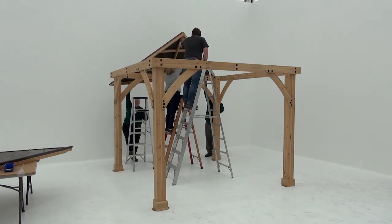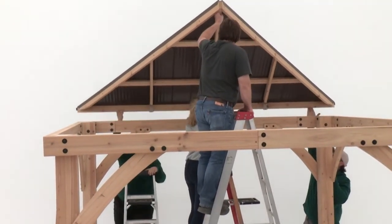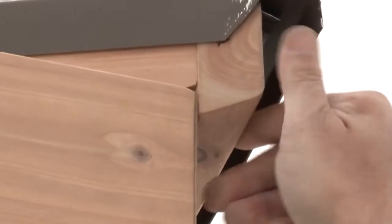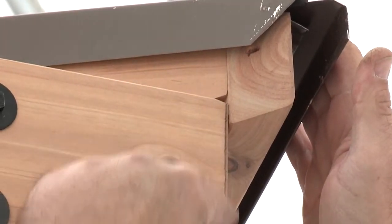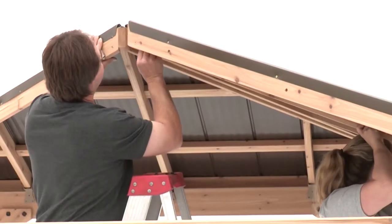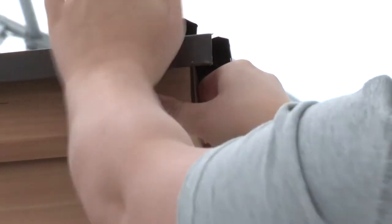Get three people to lift a roof panel over a side of the assembly — be careful not to damage the roof panels or scratch the beam. As the person in the middle holds the top of the panel in place, make adjustments so that the middle rafter beam bracket is lined up with the center mark. In the correct position, the mitered edge of the fascia will line up with the corner of each beam. Next, lift a second roof panel into place beside the first one. Make sure they're flush at the top, the edge of the fascia is tight to the beam, the outside corners line up, and the bottom edge of the corner rafters are flush. Attach loosely with hex bolts starting from the hole at the bottom and working up to the top.